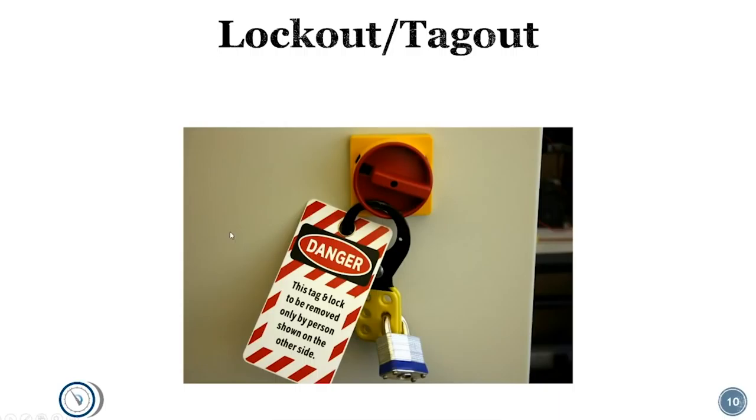One of the most important things to have on your truck if you're doing electrical work is a lockout/tagout kit. This is true of almost every segment of the industry — residential, commercial — because even in residential multifamily work, you may have to go between floors and work on equipment where you're not line-of-sight to the disconnect. A lockout/tagout setup allows you to independently lock a piece of equipment off at the disconnect so that you're the only one with the key who can unlock it and turn it on. You can put multiple locks in the lockout/tagout device so that if more than one person is working on the equipment, everybody is protected — everyone has to unlock it before the equipment can be turned on. If you're removing a rooftop unit or doing significant work past the disconnect side, definitely make sure it's locked out and tagged out so somebody doesn't accidentally come along and turn it on.